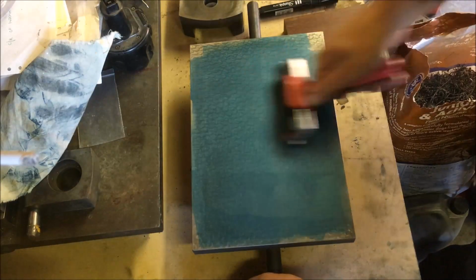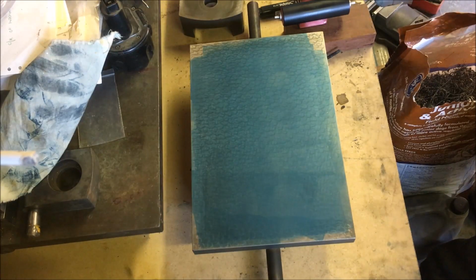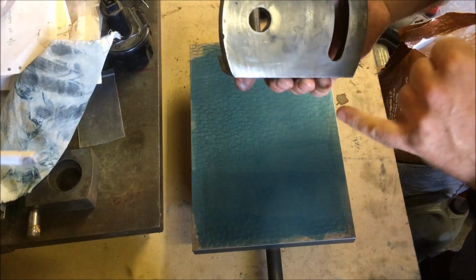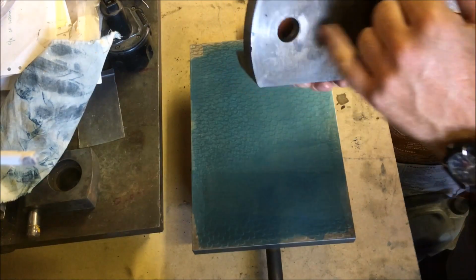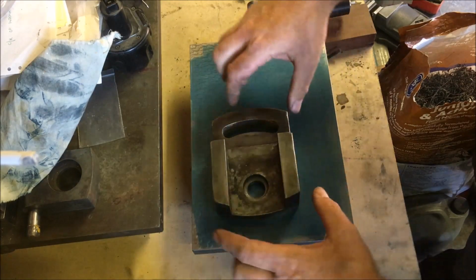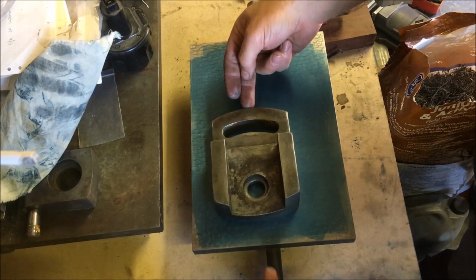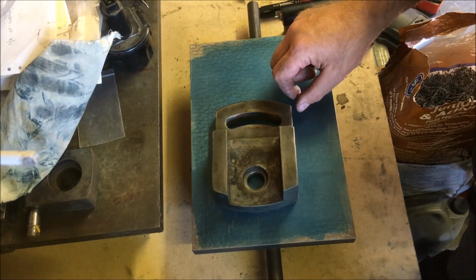Now I'm not looking for high points per inch contact, but I do want something around 10 points of contact per square inch and about 50% of the area printed. Now bearing in mind it's a machined finish at the moment, looks like it's almost fly cut. I'm not expecting it to print very well, just a smear. I had already deburred it and I'd already cleaned it off. So I've lowered it down gently so it doesn't get hard on at one side, and then I'm just going to do a small shuffle. Now I can tell you now, there ain't much touching.